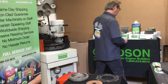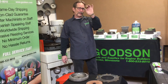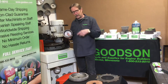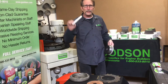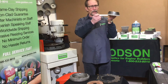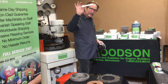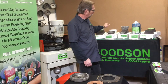With a CBN wheel, we cannot use this type of star dresser — no way are we going to run this machine-mounted dresser across a $200-plus grinding wheel; it'll shatter and completely destroy it. When it comes to dressing CBN, we need a special CBN dressing stick. With the machine running at 3,500 RPM, you hand-dress it — get in there and unload or abrade the material to expose new cutting edges. So: hand-dress CBN, star-dress the vitrified abrasive wheels.